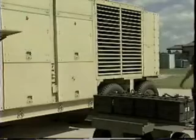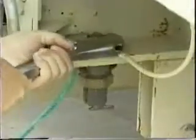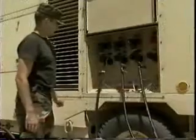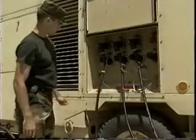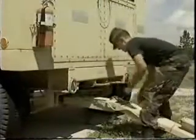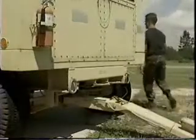The MEP 12A generator set pre-operational inspection begins with a thorough walk-around visual inspection. It is imperative that the grounding of the generator be checked. All distribution cables should be inspected for nicks, burrs, and worn spots. Ensure the unit is free of any tools, rags, or spare parts that may have been laying around. Don't forget to double-check the parking brake. Once the generator is operating, vibration may cause it to move.